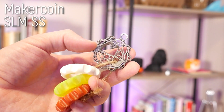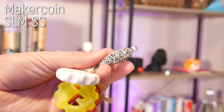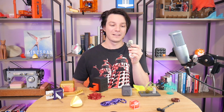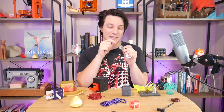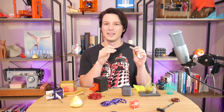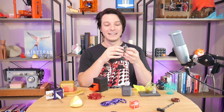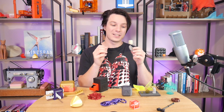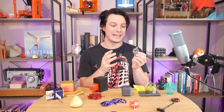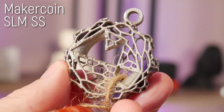I even made a quick video about it because I was so blown away by this. And this is made with stainless steel powder that's actually melted together layer by layer, similar to the SLS nylon, but actually metal, real metal. But the thing about this, and I didn't know at the time, is you still need support structures with metal SLM, selective laser melting. And it's not so much that you need support structures because of overcoming gravity, but it's because the parts actually change density as they get melted together, and you also need to dissipate heat. So you need structures to help keep the part in place in the powder bed instead of shifting or deforming due to heat, which is why they've carefully gone through and picked out the support structures, but in some small areas you can still see them.